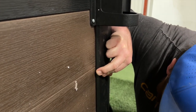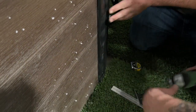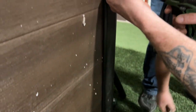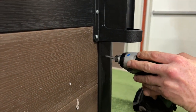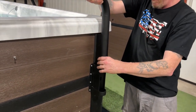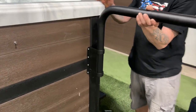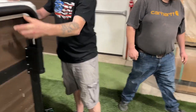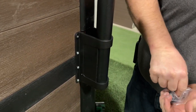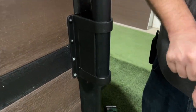After the next cut, the section removed is discarded and we're going to attach the bottom trim the same way, inserting the screws through the trim into the gap and into the two-by-six. We're going to put the shelf bar back into the bracket. Now we're going to put on the little plastic screw caps — just remove them from the bag and press them firmly over the head of the exposed screw. This will protect them, make it look nice, and keep them from rusting.